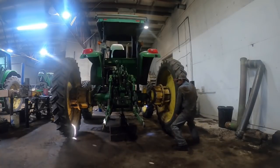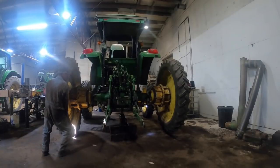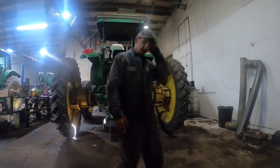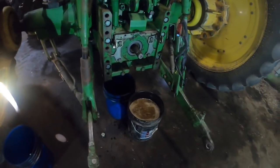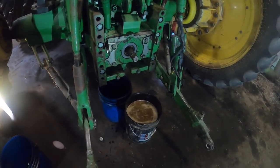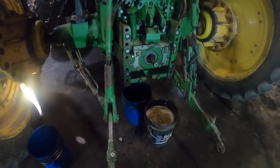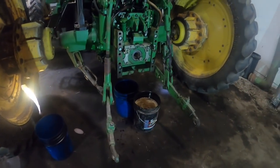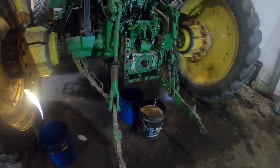Go ahead and take the jack off, dump the oil, and see what the hell's wrong with it. One thing is for certain — the hydraulics don't work very well when there's no oil in it. It had five gallons in it still drizzling in there. That bucket easily holds about 15 gallons and there was five gallons in it, so it's 10 gallons low on hydraulic fluid. Amazing there aren't more problems than there are.